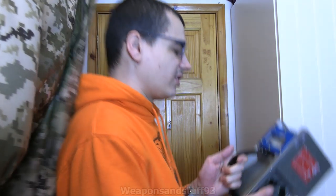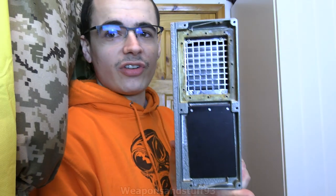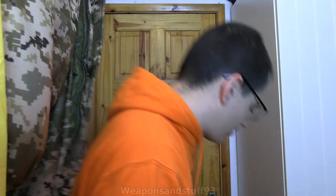For most people I think the phone Geiger probes are the simplest thing — unless you've got one of those Apple phones without a headphone jack anymore, which is completely stupid. If you just want to plug it into a phone and get a readout, it does that fine. When I've tested them, you can get beta radiation to register through the little end bit, they register gamma rays fine, and they give a pretty close dose equivalent to more expensive Geiger counters. They're pretty convenient and fit in your pocket. All of these have advantages and disadvantages even going up to the Terra and GMC-500 price range. I don't think there's ever going to be a perfect Geiger counter, but it depends what you want. For a lot of people who aren't concerned about background radiation but want to know if there's a nuclear disaster, the ionization chambers would do that — they'll detect if anything really bad is going on.